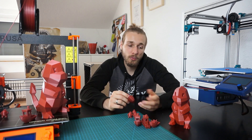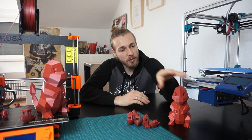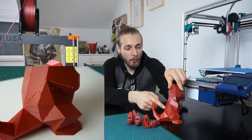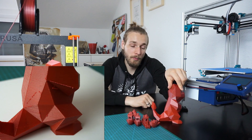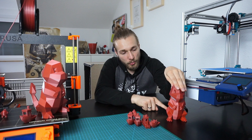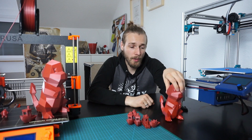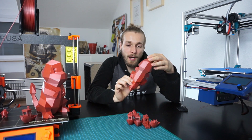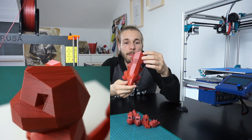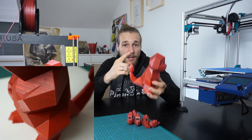You have to tweak the settings between every print. The Charmander came out quite good for its size, except for a stringing issue on the back side which you can actually remove for a smooth surface. But what you can't really remove is two layers with under-extrusion where the layers aren't fused together — likely caused by high retraction and high temperature. Overall the print quality is pretty good for a self-assembled printer. Check out the pictures.